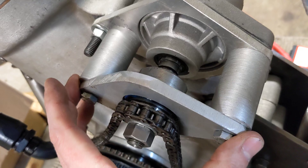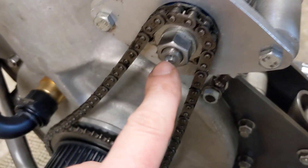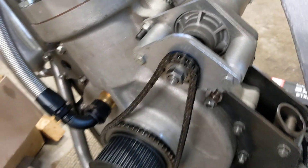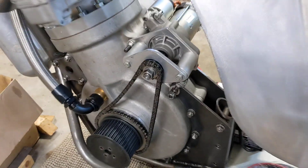Some support for the support bearings, then the keyway for the nut on the end — and it just needs a little bit of play taking out of that — and then refit the chain and remake the chain tensioner assembly under here and everything else.